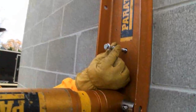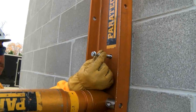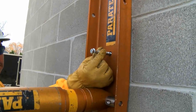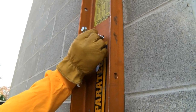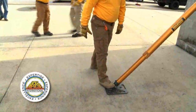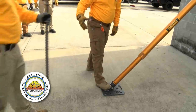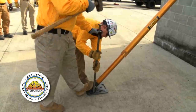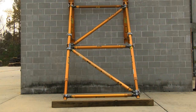Since this is a block wall, we can use devices designed for this like Hilti anchor bolts or concrete screws. Using two bolts or pins will prevent the raker system from twisting. Put one down low on the wall plate; if they go up higher, put in a second one. Now that we have a raker attached to the wall and the angle is correct, pin the base plate to the ground. Pinning it to the wall will prevent the raker from sliding up the wall if the building starts to move. Pinning it to the ground will keep it from sliding away from the wall.